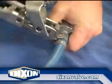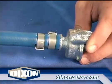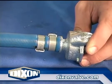Make sure the clamp buckles are offset. Properly tension the clamp, set the lock, and snap off the clamp tail. Two clamp installations have a cleaner appearance, are less likely to leak, and have greater holding power than a single clamp.